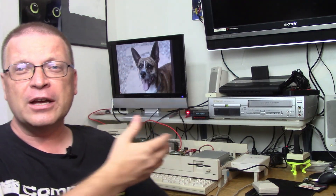Take a look right there for a link to those videos. In a nutshell, the RGB to HDMI is a cool device that uses a Pi Zero to take over some of the functions of the Denise chip, which is physically attached to it, de-interlace that and send it out via HDMI on our OCS-ECS machines. And it looks beautiful. So we've got the solution for the Amiga 500 and the Amiga 2000.